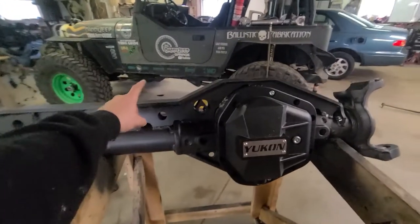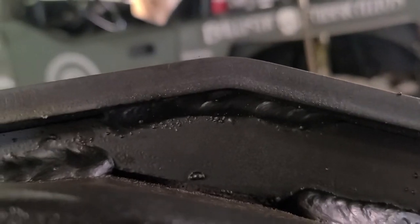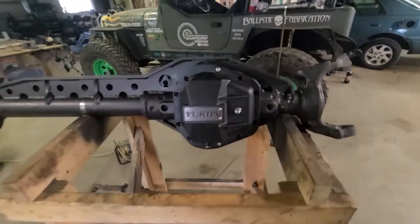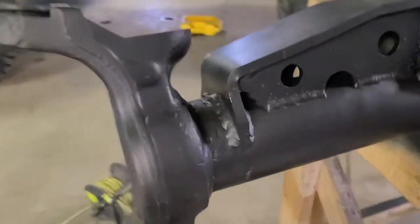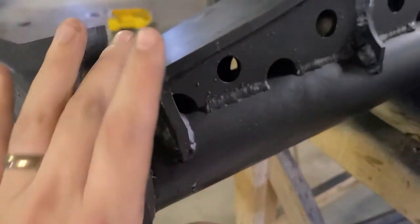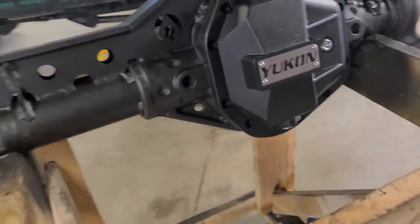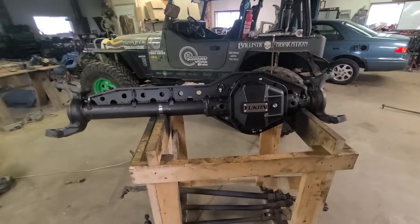The ram mount actually ties in with this low profile truss. There's a piece here that's going to get welded in — I forgot about that, so I inadvertently put a nice weld in there and I'm going to have to grind it out a bit. It also wraps around the edges of this truss over here, so I'm going to have to grind off about an inch on both sides so it wraps in nicely and gets welded to the truss as well as the tube. First step: take off some weld. I'm going to use a carbide burr and then finish it up with a belt sander.